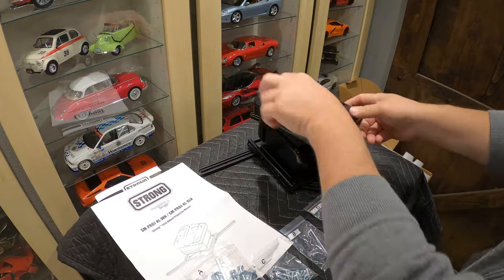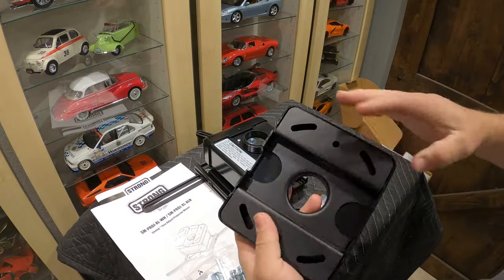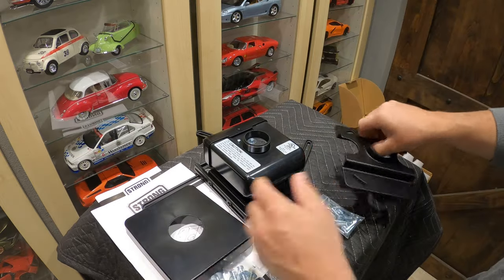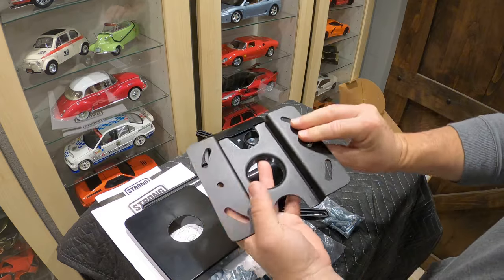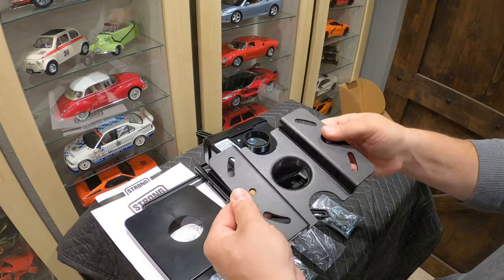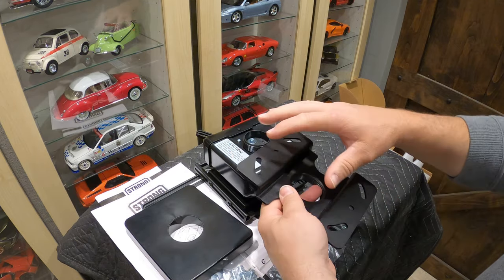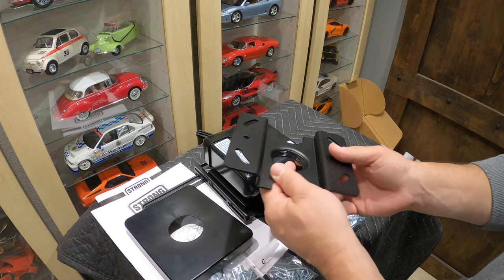Then we're going to go ahead and spin this off. It's an inch-and-a-half NPT pipe, and that's super common. If you wanted an exact length pole, you could go to almost any home store — they're going to have that pipe, they'll thread it for you on site, spray it with some black paint. We do that for our commercial jobs. You've got four outer holes that are adjustable, and that's also going to give you some ability to skew it left and right to get it perfectly centered and level on the ceiling.